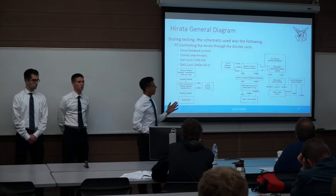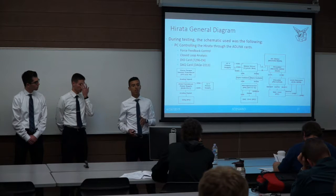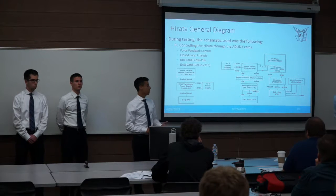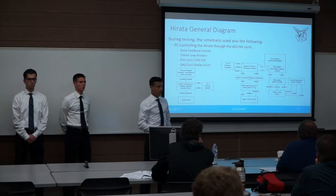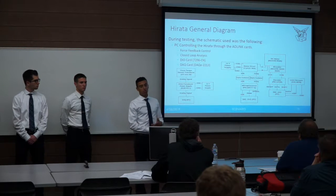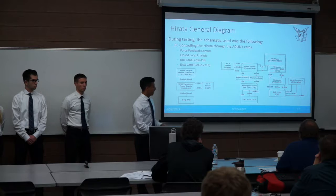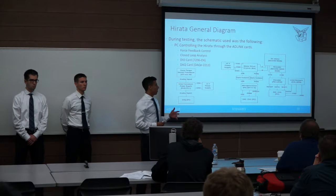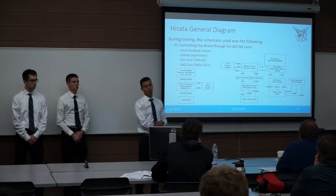Opto-isolators were needed for safety — to electrically isolate the motor circuit from the PC circuit to prevent damage to the PC and maintain constant voltage. Our microprocessors were necessary because the digital I/O cards cannot generate PWM on their own; those microprocessors, also provided by Dr. Eisenberg, generate the PWM for the motors. The schematic designed in Eagle shows channel 1 of the digital I/O outputting enable, select, speed, and direction to the microprocessor. The microprocessor produces direction and PWM for the opto-isolators, which then feed the motor drivers. A voltage regulator steps 12V down to 5V to power the opto-isolators.